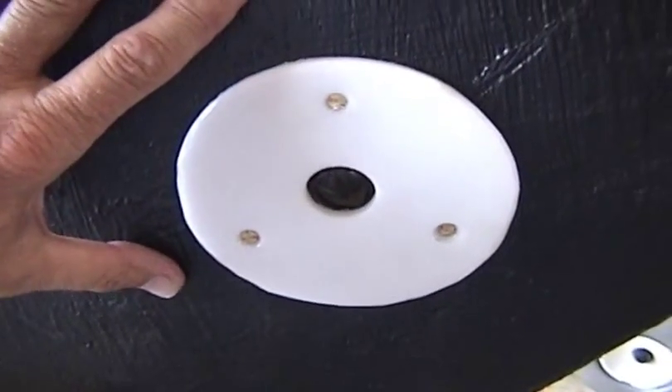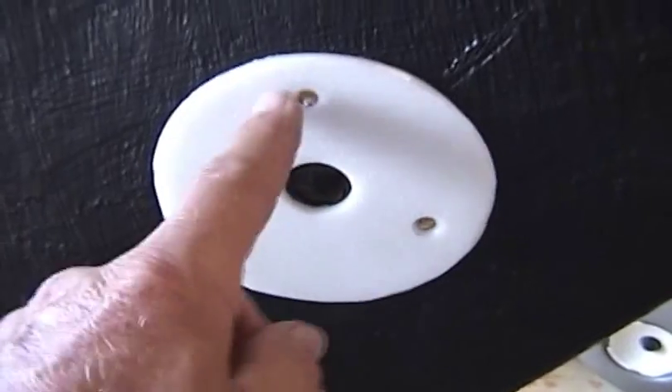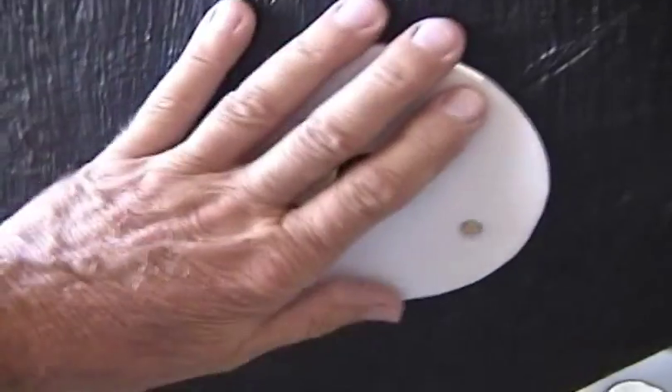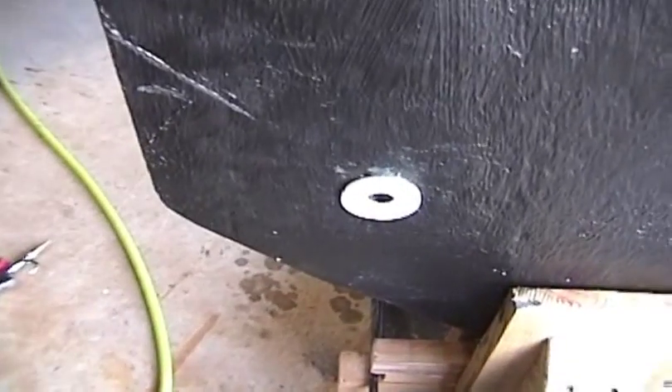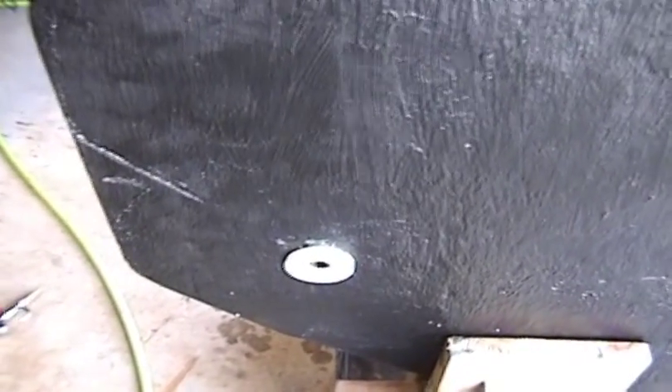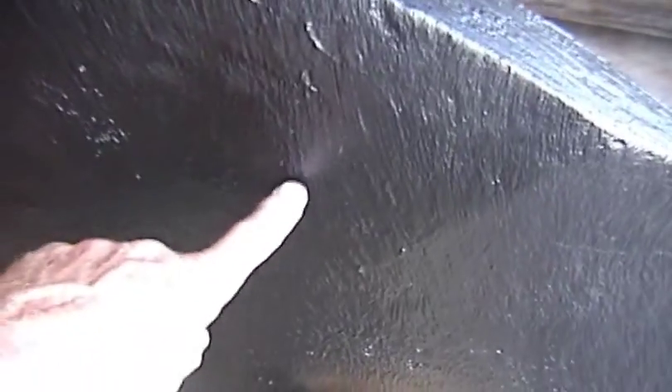The brackets and we've got about two and seven-eighths between this side and the other side. This is the starboard side and I used three brass flathead 6-32 screws, drilled and tapped in and countersunk them. This will help keep the keel from rubbing on the starboard side of the keel trunk. On this side I have a smaller disc which is less than a quarter inch, and that's going to take up some of the slack against the center of the keel bracket. Then you have your nylon rod that comes through the side of the keel trunk up above that pushes against this side — that's why the starboard side of the keel trunk had some wear which I had to fix with epoxy.